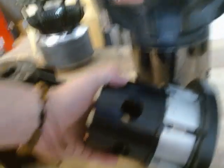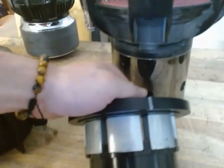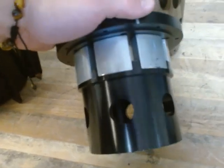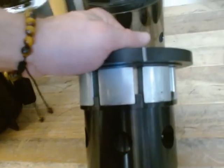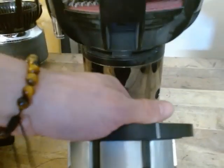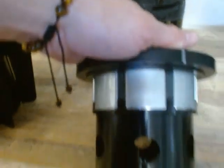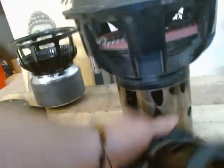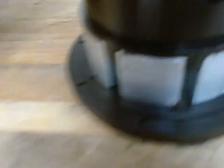Going to the V5, the biggest difference between the V4 and V5 — other than going to an eight-layer coil, which you can see this assembly will go deeper in the motor — is it extends the shorting ring all the way down, a lot more heat absorption. One of the big things about this motor design is that it allows us to use neo without the neo getting hot. We have multiple pathways, even here top and bottom of the neo, to take the heat from the gap and put it out to the steel cylinder. In this one of course we just have more internal heat sinking.